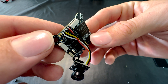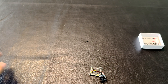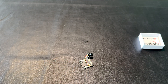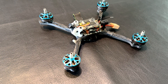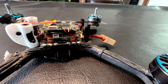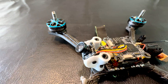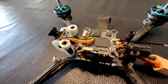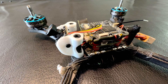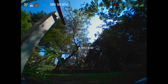This VTX is capable of 25 milliwatts to 200 milliwatts — I'll be testing it at 25 in my video. It's 25x25 with M2 soft mounting, so if you want to put it in a 5-inch you might have to tape it in. It has antenna retention built-in and only weighs 4.5 grams, or 6.3 grams including the camera. I have it mounted on one of my 5-inch test rigs — an 8S capable quad I'll be running on 6S. I used a RunCam Nano 3 mount on the back and the Light Switch V2 variable camera tilt mount, with the VTX double-sided taped to the top of the stack, using the included dipole.